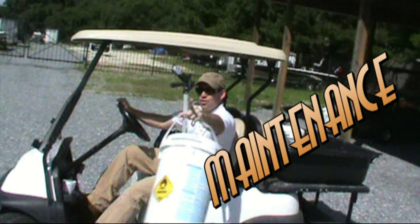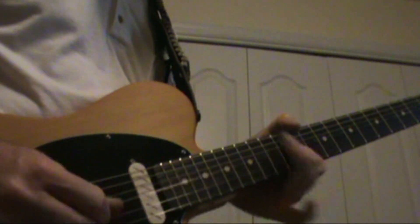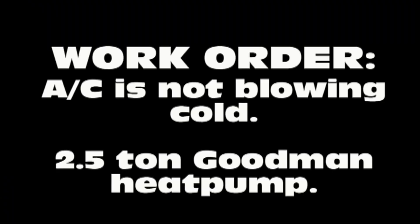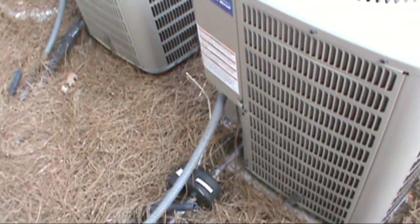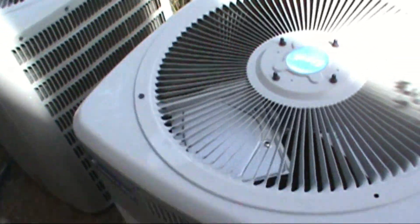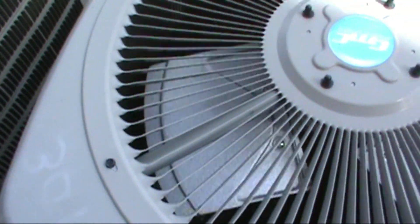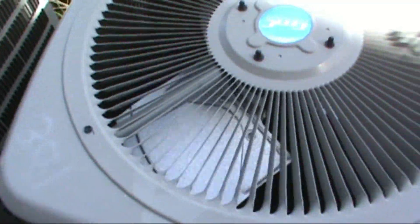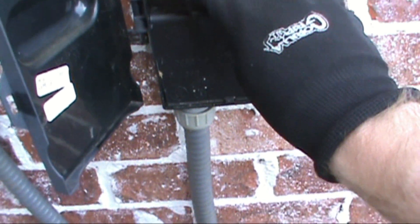Welcome to the Dirty Maintenance Show. What's going on, skids? Got a condenser fan out running here. Gonna hit it with the screwdriver to see if she's not locked up. Now she's spinning freely. Put the disconnect in — you'll hear the compressor fire up but not the fan.